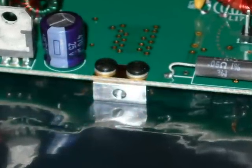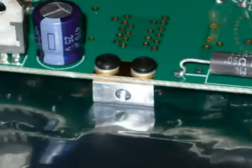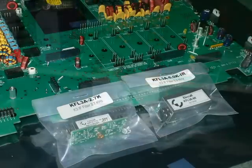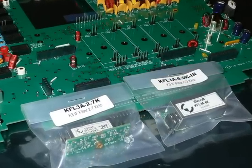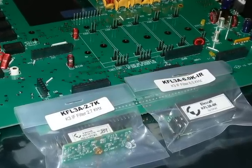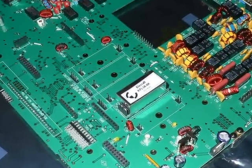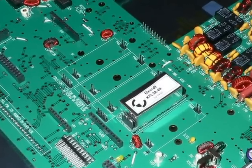The first part of the build is fitting the 2D fasteners and the few standoffs to the board — a nice and easy start really. Next is fitting the filters. This will depend on what filters you've bought with your K3. I bought the extra AM filter and this one is shown fitted already — an easy job, just one screw.